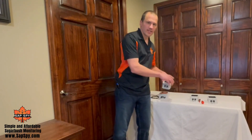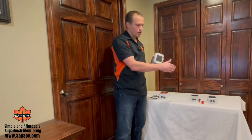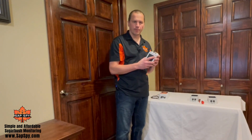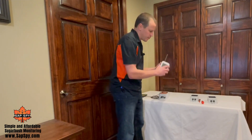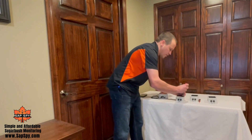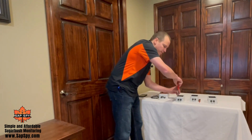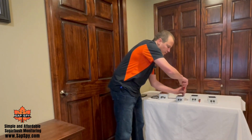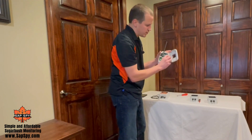When setting sensor nodes up, if you know you need a repeater, take at least two nodes and configure them to be repeaters right away. To do that, pull the cover off — there are four screws, which you can remove by hand or with an electric drill. Be careful, there are two wires that go to the solar panel on the cover.